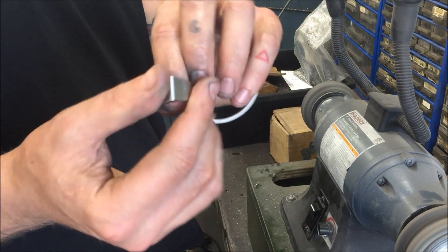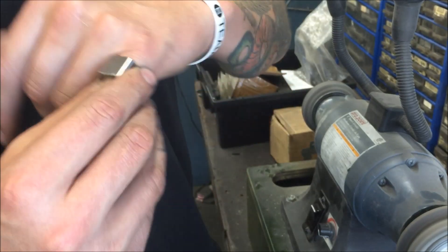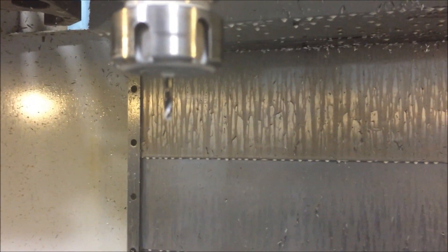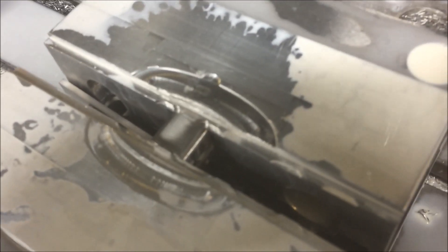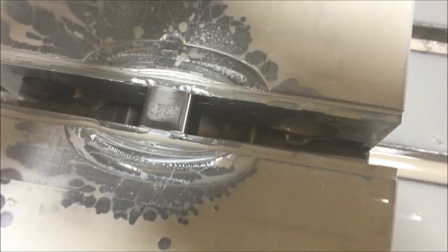It's very important to make sure there are no sharp edges left at all. There's a ring ready to go to engraving — nice and shiny, doesn't cut. We're going to put this back inside the VF5, using a 1/8 chamfer mill carbide. I just put it back in the exact same jaws — you can indicate it flat or however you want. I just line it up at the top of the jaws. And there it is after engraving.